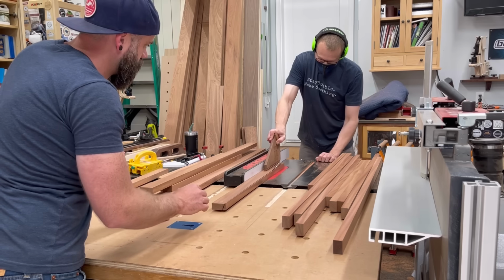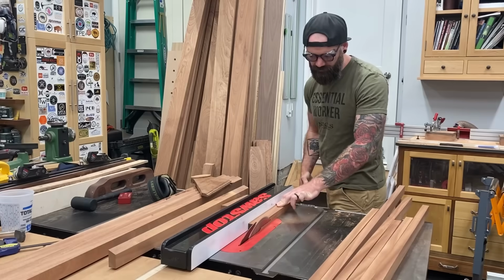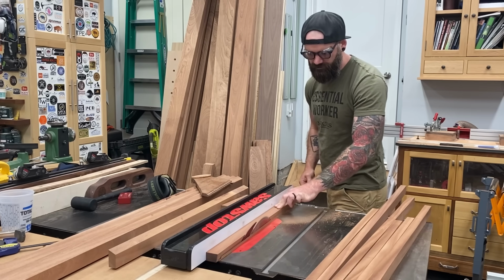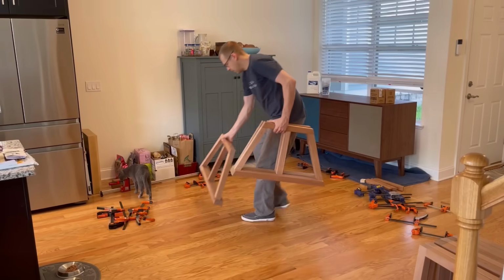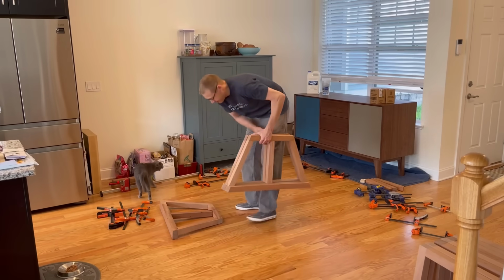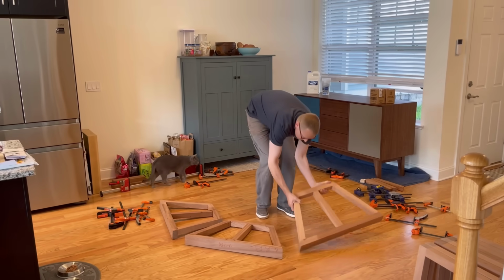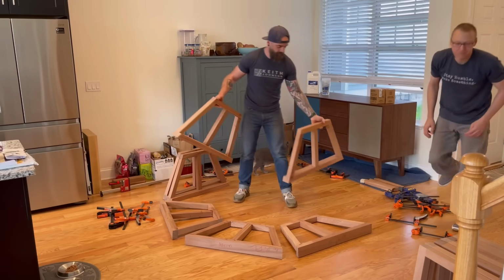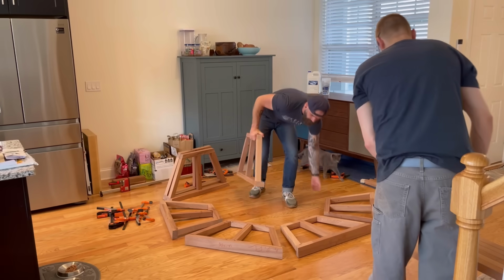Because the back slanted at 10 degrees in towards the tree, we had a lot more angles to deal with. Our side pieces were cut at 22.5 degrees, and our top and bottom pieces were cut at 10 degrees. So before we actually started hooking our frame pieces together for the backs, we decided we should roughly put our entire octagon assembly together just to make sure that we were correct with our angles and such.